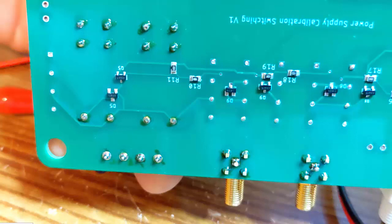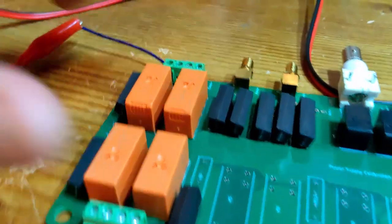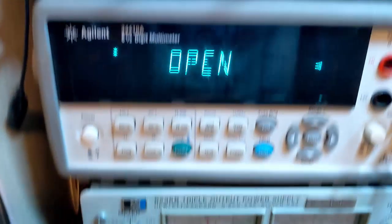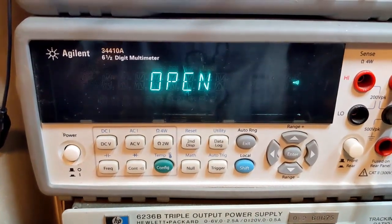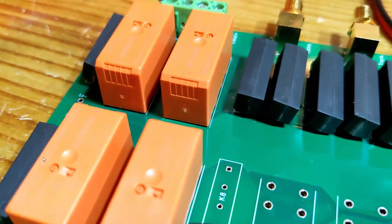The Arduino Uno runs a simple program that pulls two pins high for two seconds then low for two seconds, actuating the relays for two seconds, closing them to create a path for the DMM continuity check, then opening them again. With the power supply turned on providing 12 volts to the coil, the relays actuate and the DMM shows open then closed, open then closed. We're controlling higher voltage and current through the coils with simple digital pins from an Arduino board, while the flyback diode handles the back-EMF. You can use this circuit on one relay or multiple relays as long as you size components to handle the current.